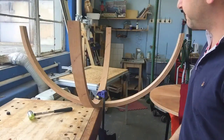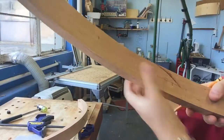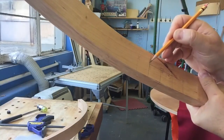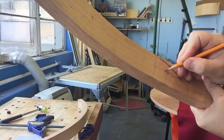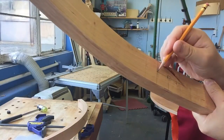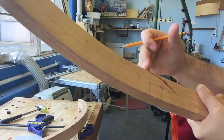This is going to be joined with a half lap, and that's going to be nice and solid. On the inside here, I've marked for my joint with a knife line. You can see my tap marks moving along as I had to move the piece out to get it where I want. This is the true centre, but the centre when you account for the twist in the laminations is about 3 sixteenths further along. It was a movement this way, not a pivot, so the perpendicular is still 90 degrees - it's just shifted further along.